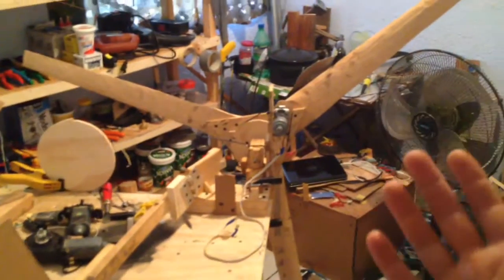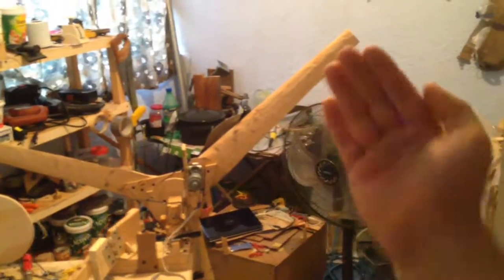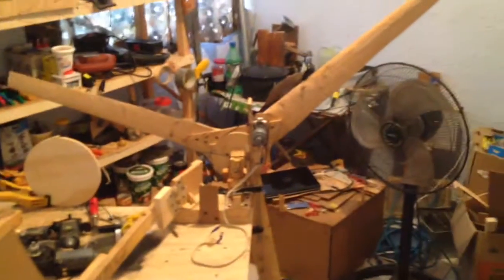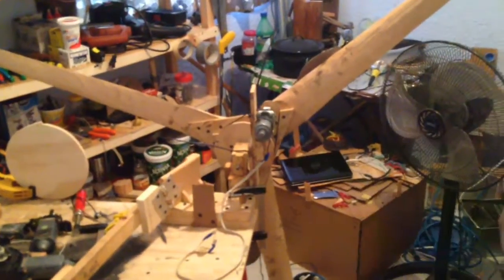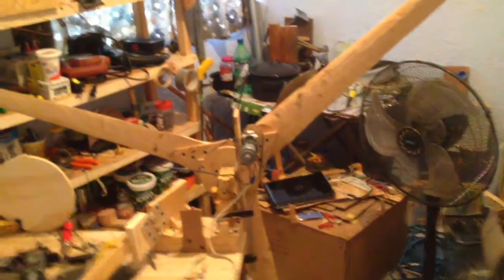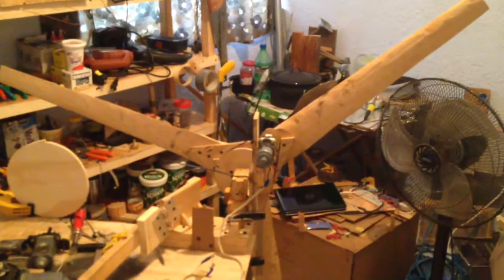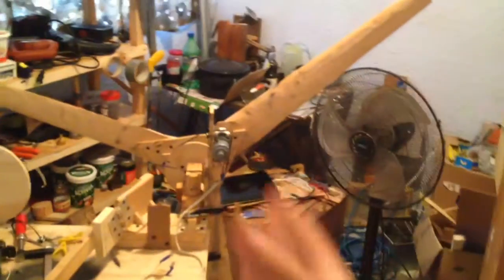It turns out of the wind so it doesn't spin too fast. The blades can bend backwards and hit the tower when spinning very fast, and there's so much energy that the blades get pulled out by centrifugal force. Also, the generator isn't sized for that much energy, because the energy the generator produces is proportional to the cube of the wind speed — double the wind speed and it's eight times more power. So you can't design it for crazy wind speeds, or you'd need a huge generator and very strong blades.